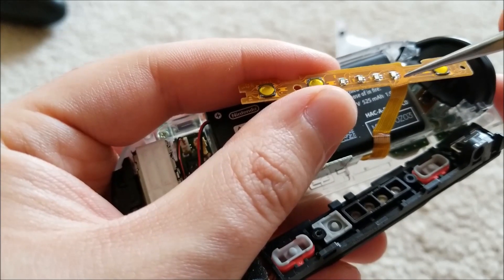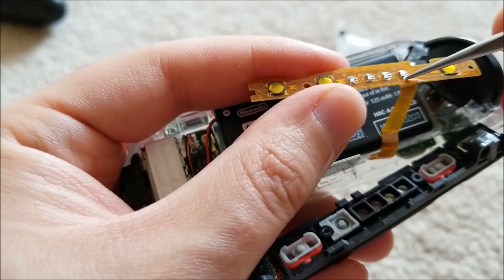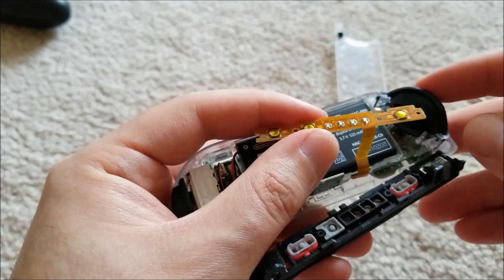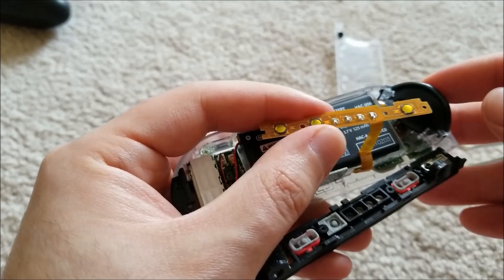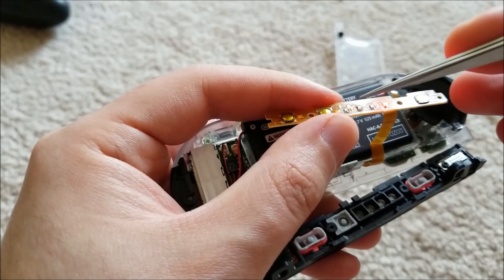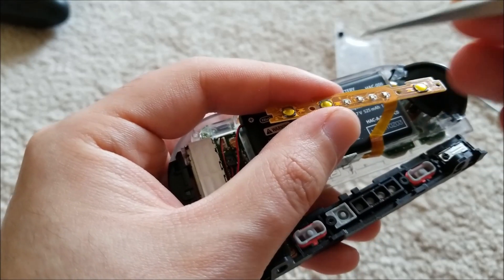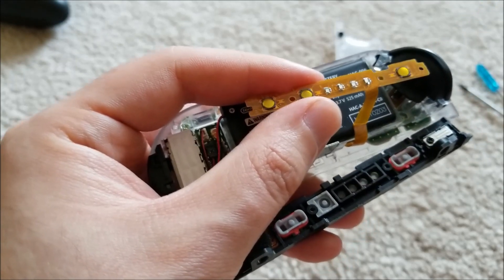Once you remove the old LED, it's pretty easy to tack down the new LED and put a little more solder on each side to make sure. One good reason to leave the cables attached while you're soldering is that, as long as you don't short between multiple pads while it's powered on, you can do a quick test. When I was doing this the first time, everything worked except for one LED — I'd spent too long heating it up and destroyed it. So I had to replace it with another one.